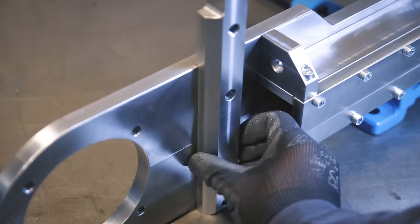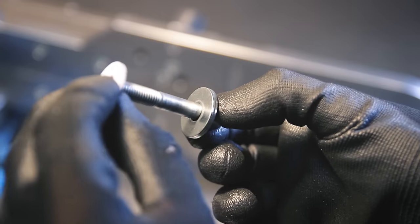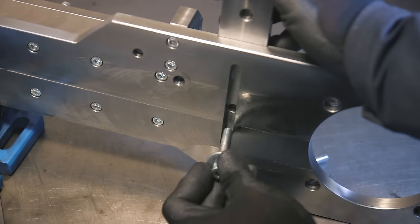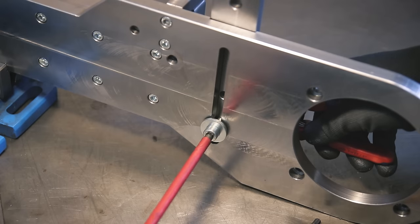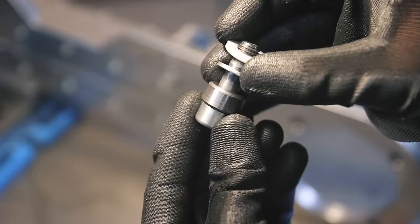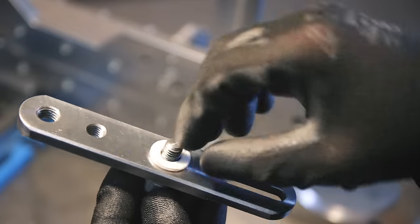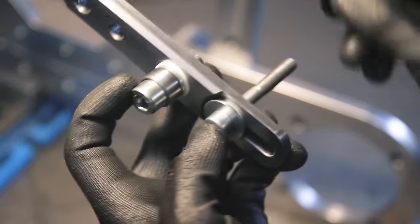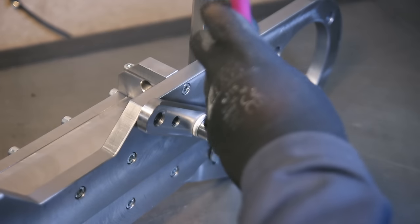Okay, now let's go over my over-complicated belt tension solution. The column goes in the slot and then it gets secured by two bolts with lock nuts, which allow me to adjust the play so it can slide up and down while allowing very little movement in any other direction. I like using plastic washers because they reduce the friction between metal parts and they are replaceable. I made these washers on the lathe and they are made of Teflon, which further helps to keep stuff sliding smoothly. The column itself is going to be lubricated by some way oil on the final assembly.